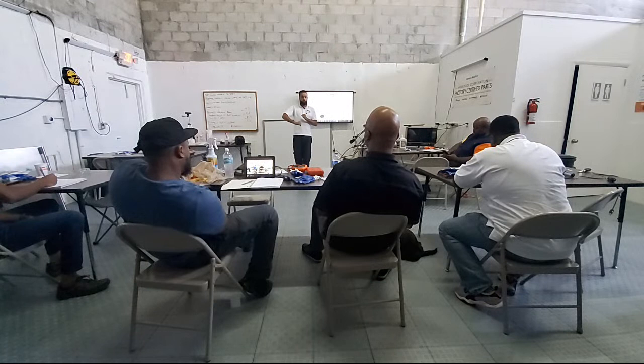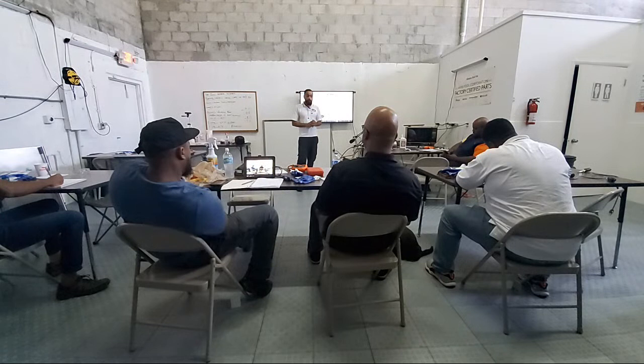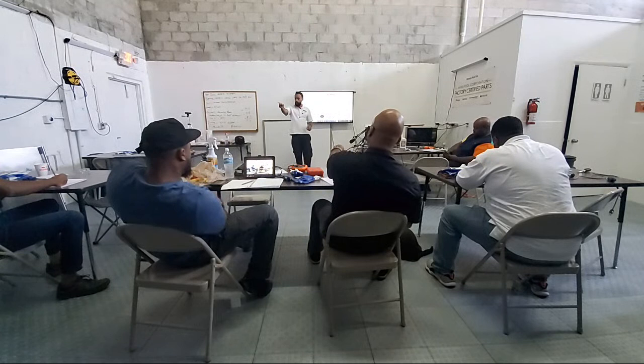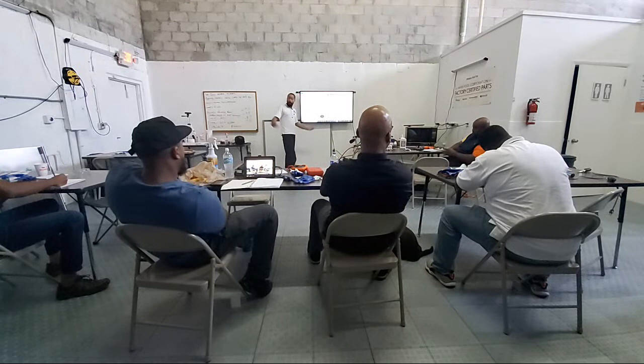A nice strong flow. If it's sputtering, you may have some stuff in there. So consistent is what you're looking for, not sputtering. Sputter will be a little restriction, or you've got some junk in there. That oil could be all sludgy. You've got to keep that up until it's clear.